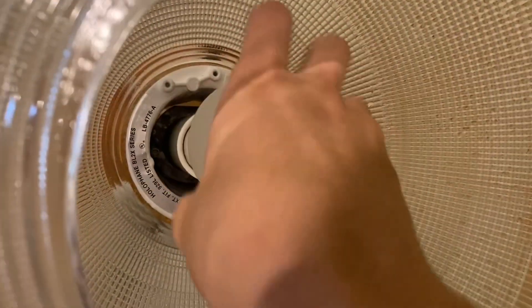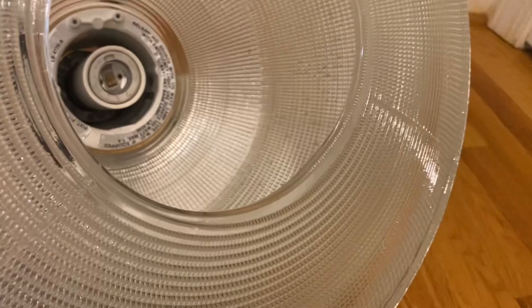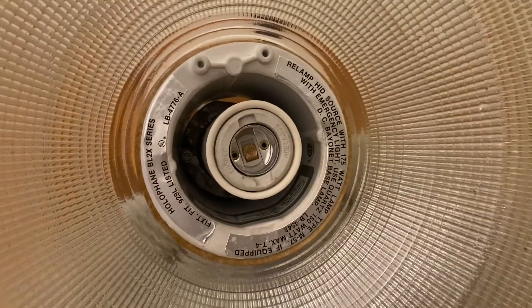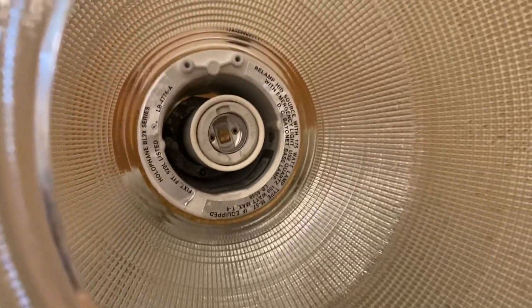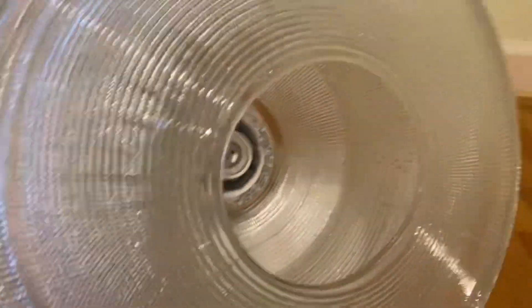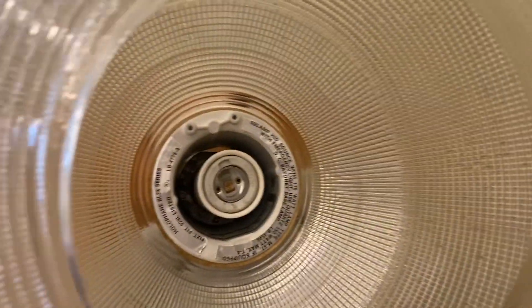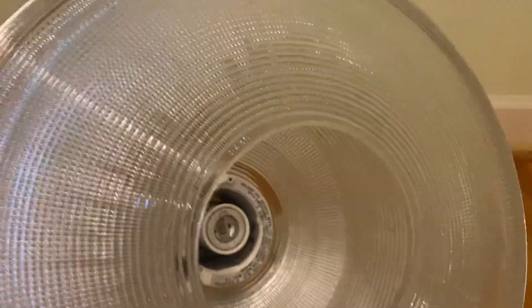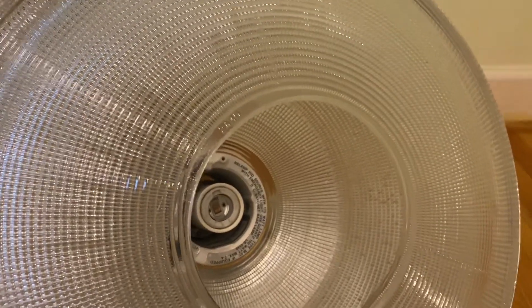Here's the lamp I have installed — it is a Philips 200 watt incandescent lamp. It used to be a 175 watt metal halide, but the ballast was one of those F-can style ones. I put a reducer in it. It was just abandoned — the ballast that was powering this was just abandoned in the ceiling when the LEDs were installed. The wires were just cut and it was abandoned in the ceiling.